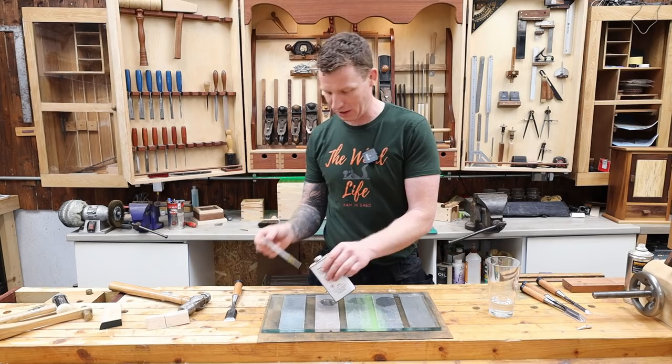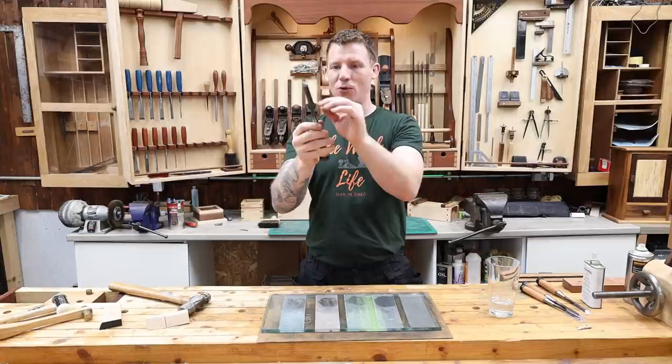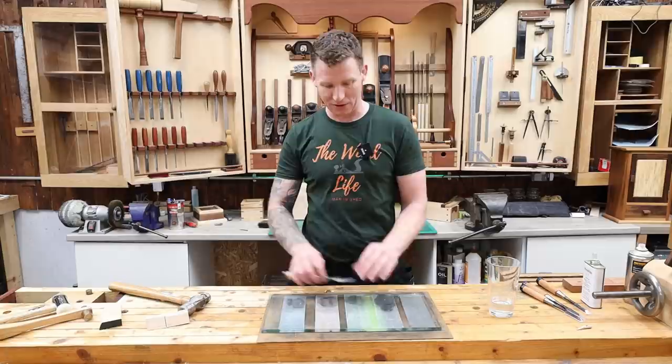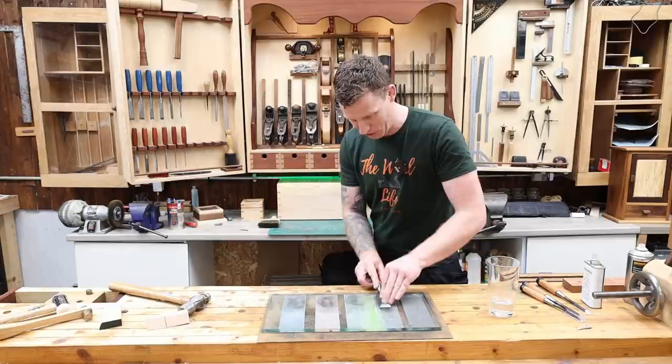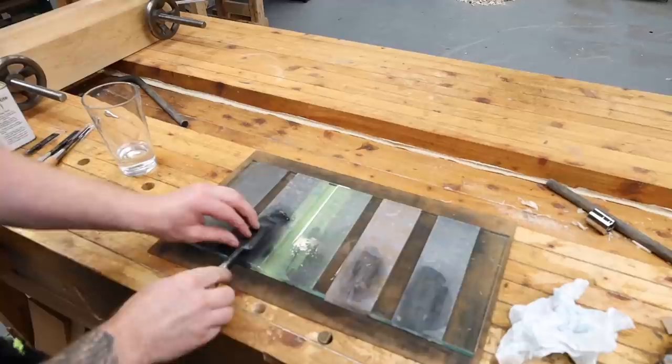The handles on Japanese chisels are slightly angled upward, unlike a western chisel which is more straight out. I'm flattening back up to the flat part of the handle, working forward and backwards. My setup means I'm moving up and down rather than across. Starting on the 40 micron finishing film — there's a 100 micron for really aggressive stock removal but I don't need that. Working back to the flat part on the stem.